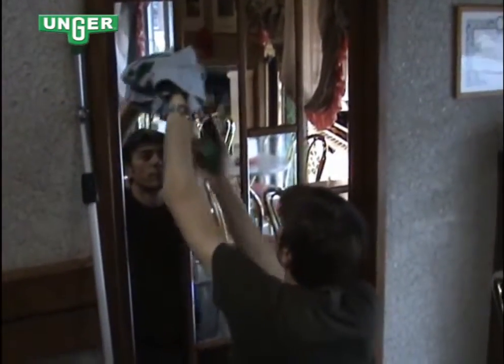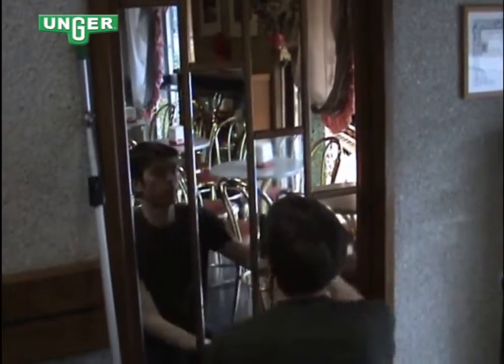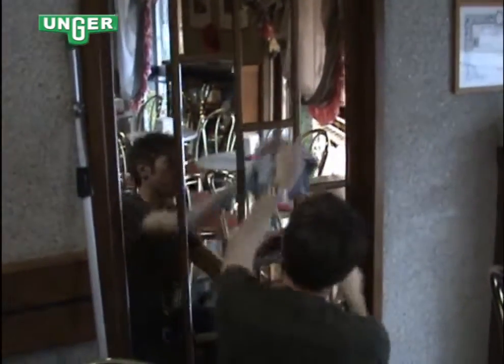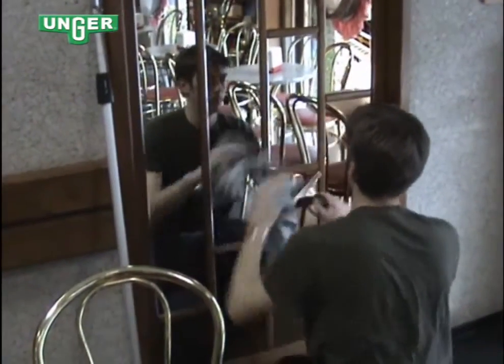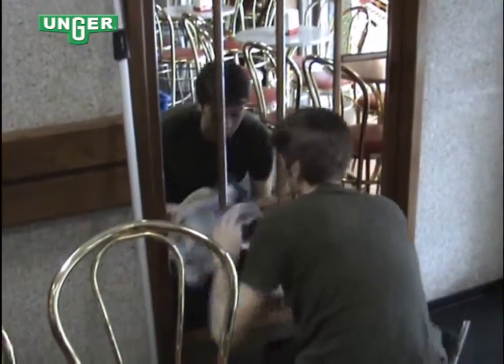If the cloth becomes too damp, it will leave smears on the window. It's better to keep a stock of clean cloths and change them. As the dry cloths become more damp, start using that as the wet cloth and grab a new clean one. A good window cleaner should only use 1 or 2 dry cloths a day.